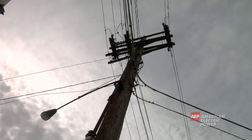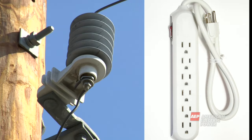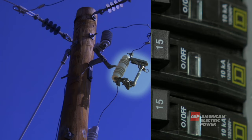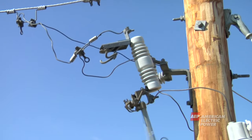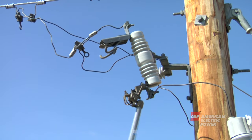The next piece of equipment typically found on a distribution pole is a lightning arrester, similar to a surge protector in your home. A lightning arrester protects the pole's equipment from being harmed by lightning. At about the same level is the cutout, which is similar to a fuse in your home. It protects the pole and its equipment from too much electricity. If a squirrel or tree branch were to come in contact with a wire, the cutout will open, indicating a problem with that section of the line. If you ever see an open cutout, be sure to call your power company.